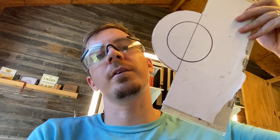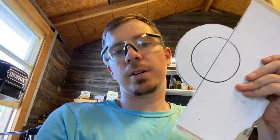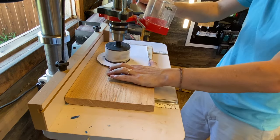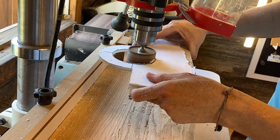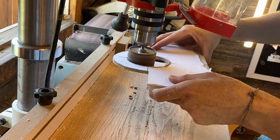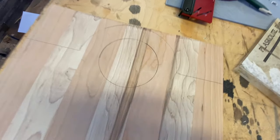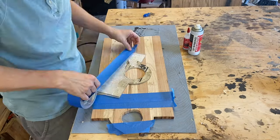I told myself to cut the big hole before I cut the round handled shape because I was worried that less material would mean it would crack. But I didn't do that — not in a bad boy kind of way, but like a dummy who forgets and doesn't do things in the right order. So we're going to do this and pray that it works. To make this jig, the first thing you want to do is get your piece of acrylic and create a horizon line. Then in the center of that piece, create a circle with a diameter of about three inches. After that, measure out an inch on each side — because an inch is probably the minimum for the handle — and then create another circle that intersects with those points on your horizon line.